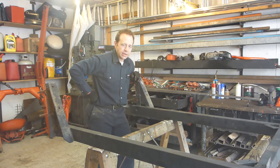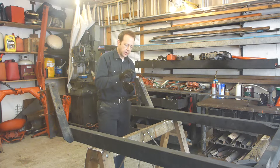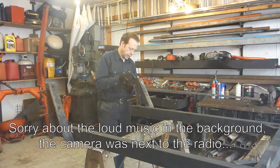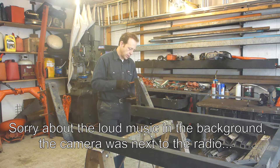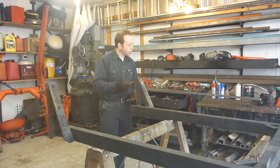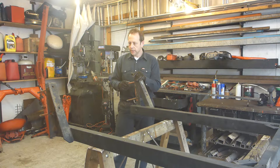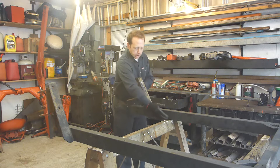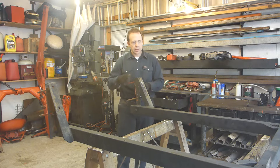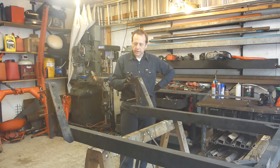But it's not exactly what it could be because this is 3/16 of an inch thick iron angle, and it's not strong enough to provide proper protection. So I'm going to beef up these sections here, beef up the bolts — going from a half-inch bolt to three-quarter inch bolt, graded steel. I'm also going to add some reinforcing at the back and some gussets at the top.